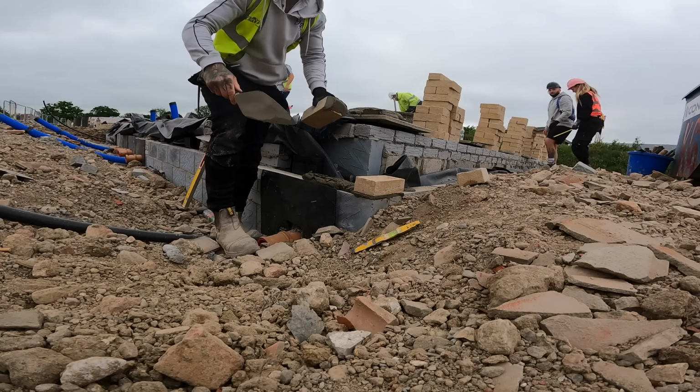Right, so here's your bays, which are there. These are your air vents in here. The blue line around the outside means underbuild, because obviously you can see the road shoots down like that. So that's why we've got underbuild over here. And the green means two extra courses on top of underside of beam. We always have four on this site above underside of beam. That's the finished height DPC on the outside.